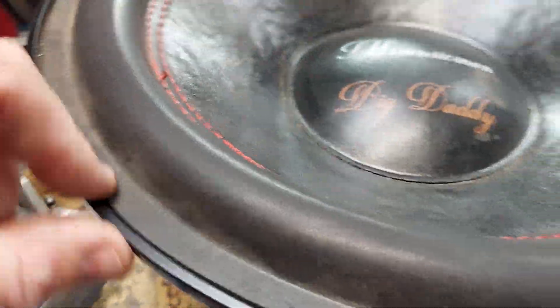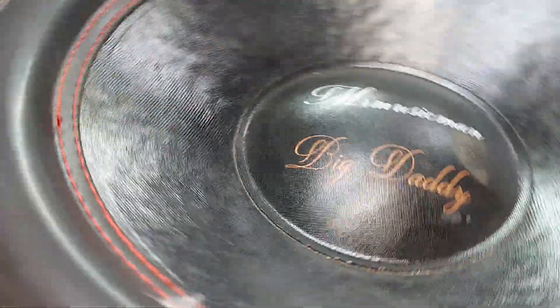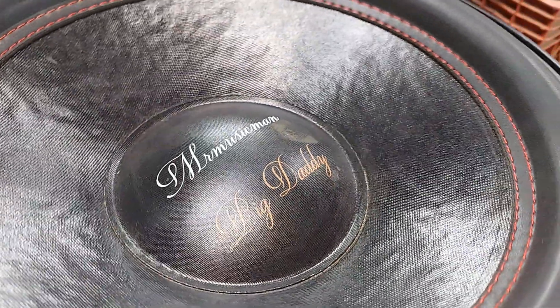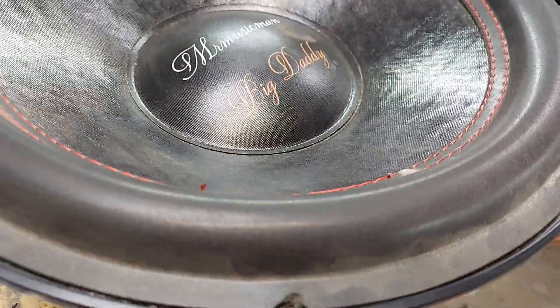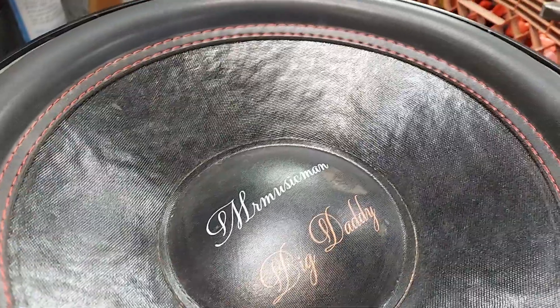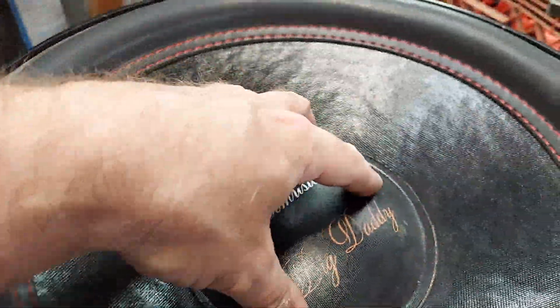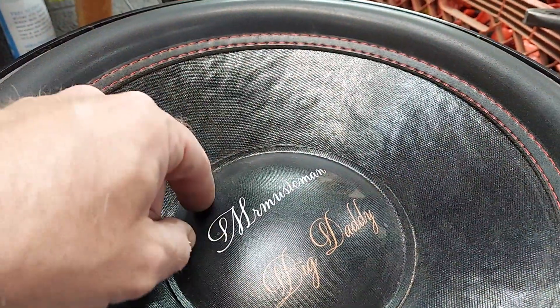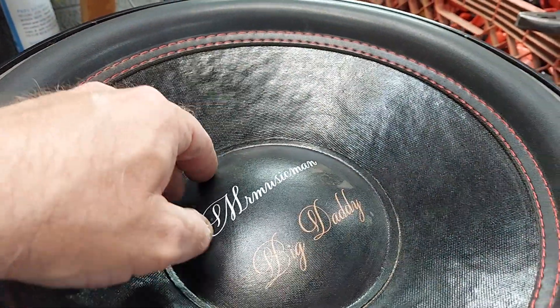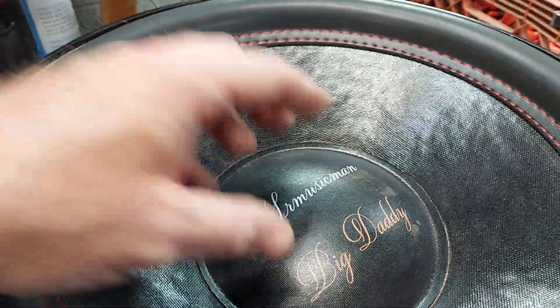You can trim it, it's not a big deal. And then I got the glue drip from China, so I just pass it off and they go, okay. But we will put a gasket on this. Let's see how stiff it is — it's pretty stiff, so we don't need to reinforce this. Sometimes if it's a really shitty dust cap, I'll cover it in epoxy so that it's reinforced and then acts as an inner cap.